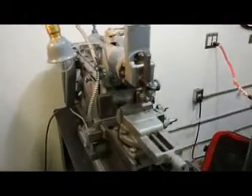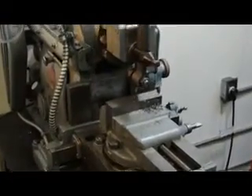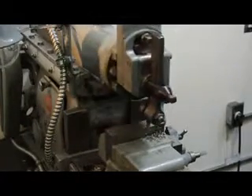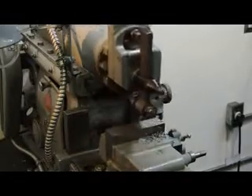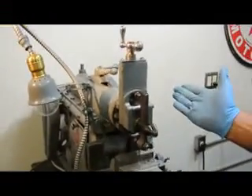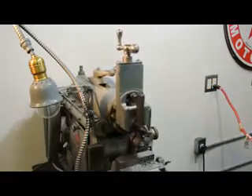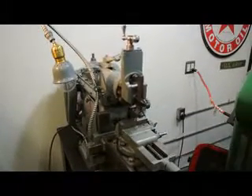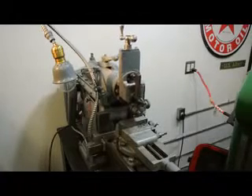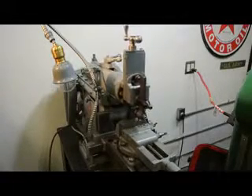Let's get back to that cut. It's very interesting and nice to do an application showing how well a machine runs. We do a lot of videos here at Machinery Consultants, but it's kind of fun showing one running under power. We can manual feed it down, we can also turn the head. We can cut a dovetail, cut a V-groove to do a V-block. Your cross speeds are adjustable, your head is adjustable, your manual tool slide is adjustable.